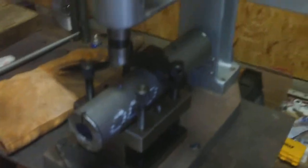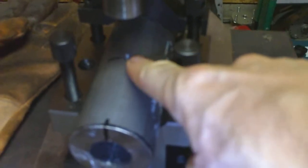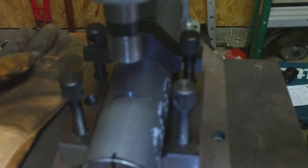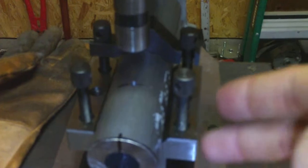In the beginning I just set the tapered tap in the hole. I visually inspect to make sure it's in the hole nice and square — you don't want the tap leaning one way or the other, front or back. So I visually inspect to make sure it's in the center of the hole. I look at it from the front and I look at it from the side, making sure the tap is sitting square as much as possible.